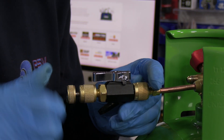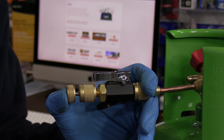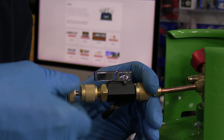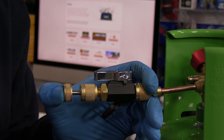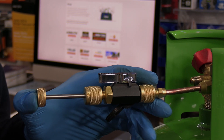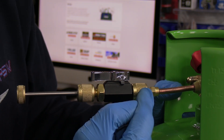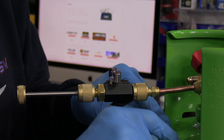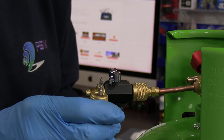Push it in, turn it, press to make sure it's home. I put my two fingers here and my thumb on the back, applying pressure with my left hand, and then with my right hand I start undoing the actual Schrader core. See how much pressure I'm fighting against to make sure I don't let it go and bang backwards — until it stops. The core removal tool has now taken the Schrader core out of the live side of the Schrader port and moved it to this side of the service valve, effectively containing all the refrigerant in the system.